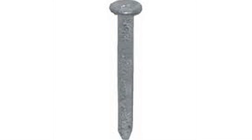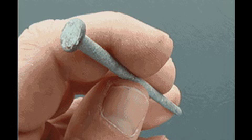It's also common to see missing nails in joist hangers. All the small holes need to be filled — don't worry about the big ones. This is a joist hanger nail; they are not just ordinary nails. The heads are designed to not break off, and they're made of the same metal as the joist hanger — that's important. They're short, but that's because they only need to go into the ledger itself and not the house. However, the nails on the side of the joist are longer, usually 16-penny nails. Look to make sure you have the right nails. If they're all rusty, chances are they're not the right ones. The heads are bigger on roofing nails, and they're reacting with the metal on the joist hanger — they're going to break off and the joist will be vulnerable to falling.